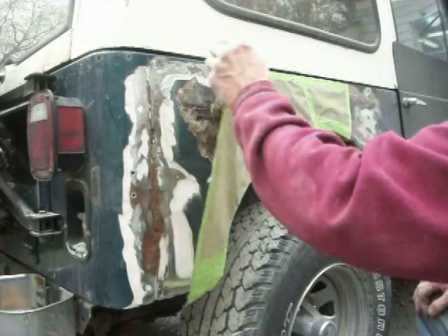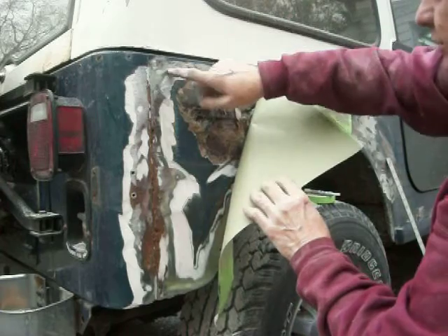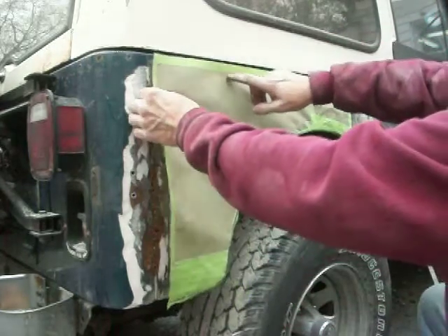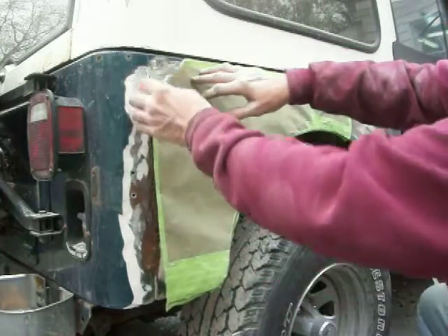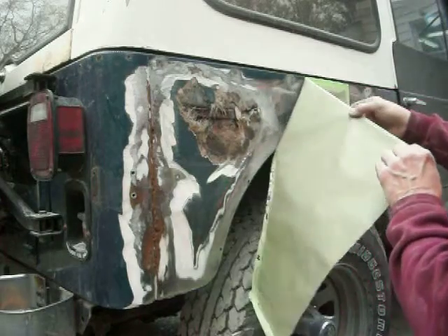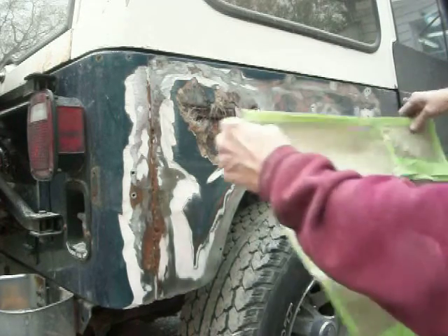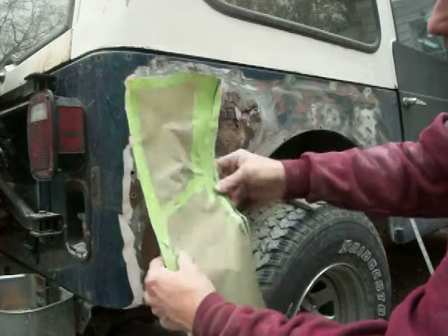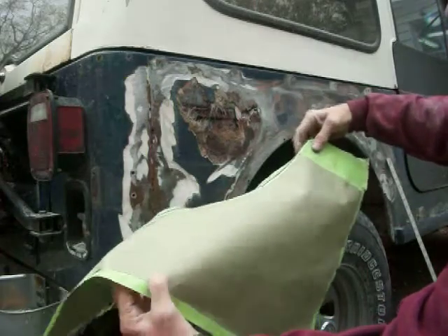So that's my start. I've got my pattern now, and because we have good metal up in here, all I'm going to do is grind it down, tack weld these holes shut, and I'll probably make the panel the same size as the pattern but shorter when I actually go to put it into place. You can see where the bend will be on the pattern, so I can follow that to make the bend for the inner fender edge.